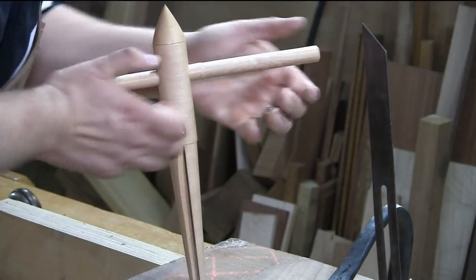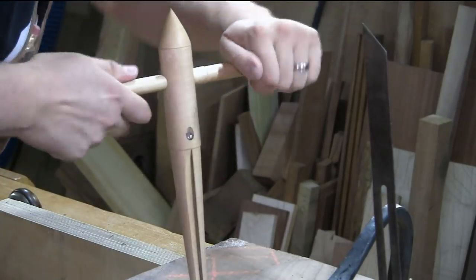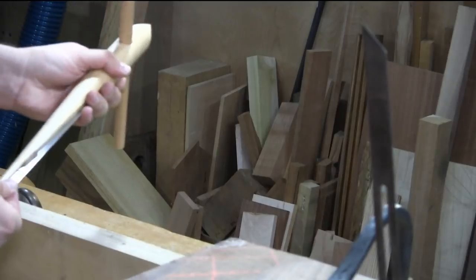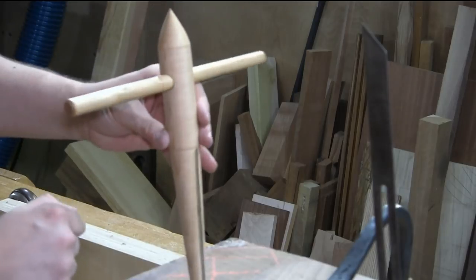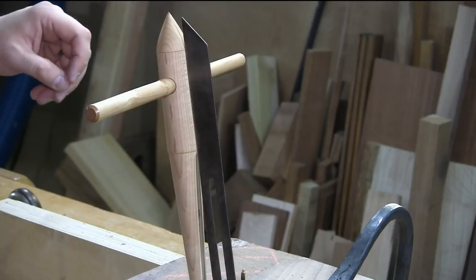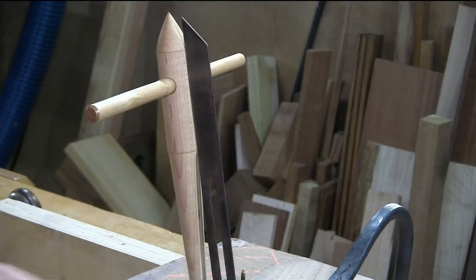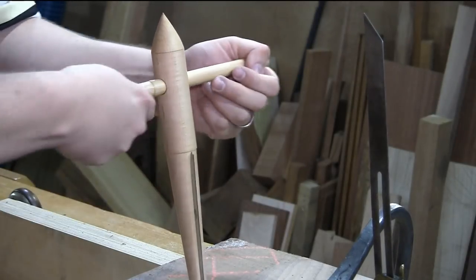So at this point, I just want to push down and keep reaming at that angle. Clear that blade. Come back and check. All right, that last pass, I leaned forward a little bit. I'm touching up here and there's just a hair of a gap down there. So what that means is now I want to kind of pull back and increase that angle a little bit.